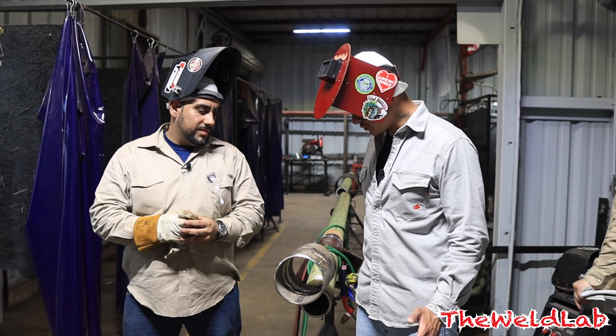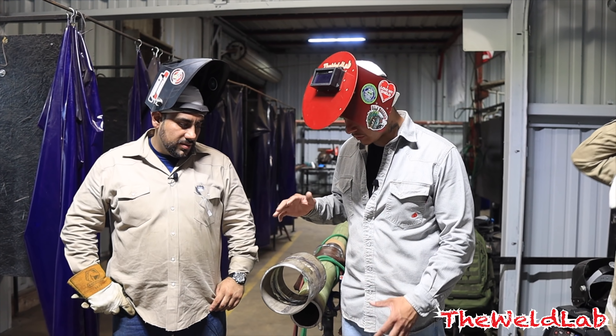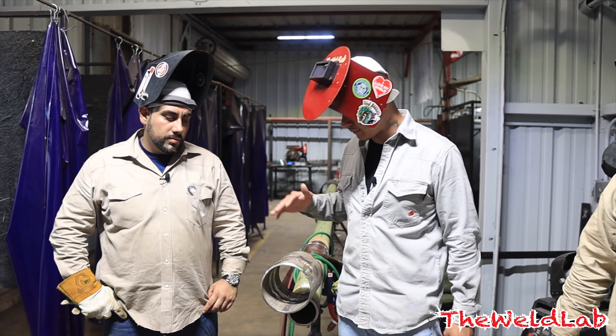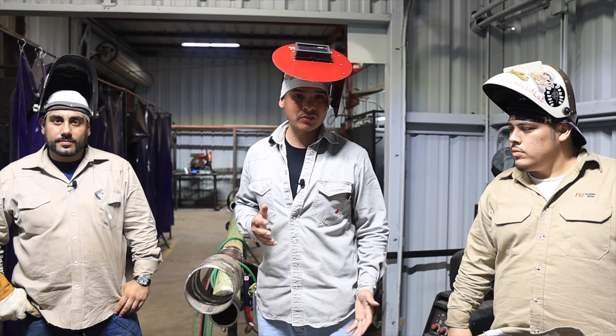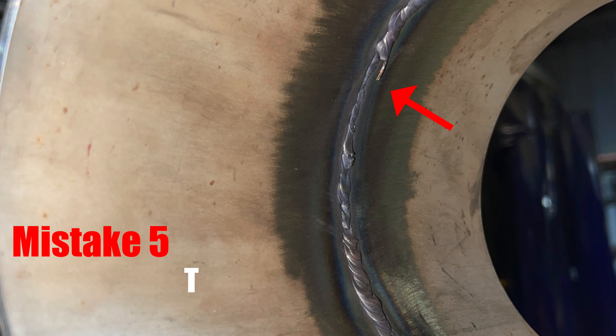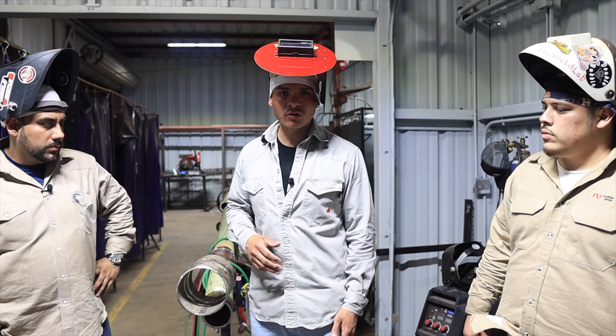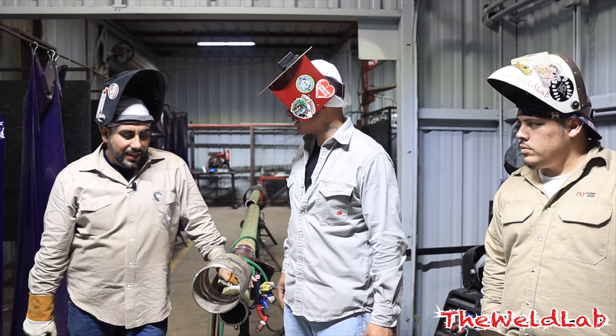We just finished welding. Arturo and I decided to flush it out and cap it because we're running low on time. The purpose of capping is to show students what to expect and show the settings — we capped at 130 and it came out really really good. On today's video I wanted to demonstrate common mistakes when doing the root. Jesus did a really good job — I think two more coupons and he'll be certified to go. He did have a little issue on one side — it came out a little flat, had a little cold wire because he didn't rip the pipe. He was trying to penetrate without a nice gap. If you're learning, just rip it, open your gap, back feed it and go — unless you can keyhole dip.